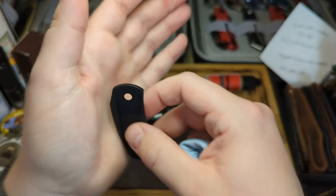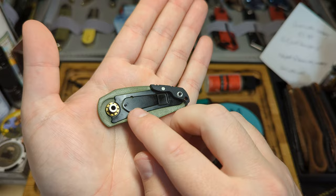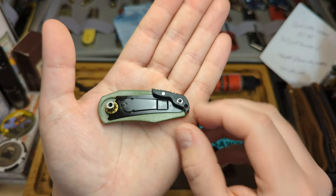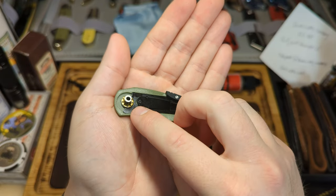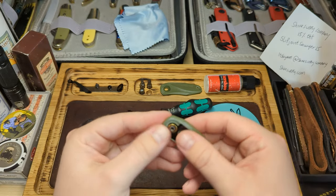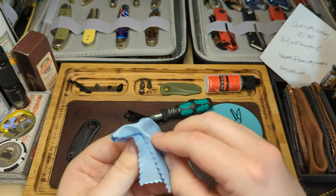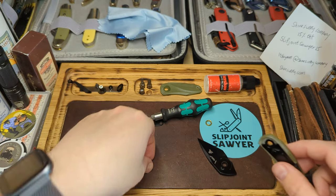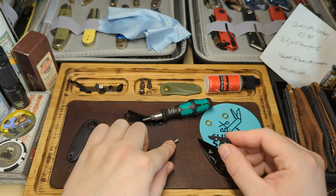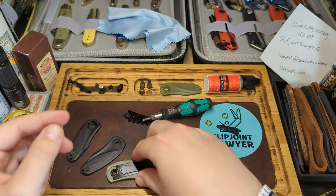There's a nice little pin that acts as a travel stop - it runs in a groove at the top to stop the blade opening or closing too far. On the other internal side you can see the detent arm, the back spacer with a pin, the internal bolt, the lanyard loop, the pivot which does come out, and the bearings again - flat side touching the blade. Take the pivot out, give it a clean of any old oil traces, and pop it in the magnetic tray. Take the bearings off and put them up there as well.